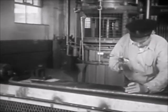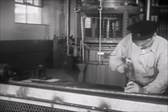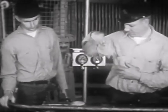If the tube has been removed for inspection, it must be properly prepared for examination. Cut the tube into convenient lengths for shipping, with each length marked clearly for ease in reassembly, identifying the boiler, the tube location in the boiler, and the part of the tube from which the section was taken.